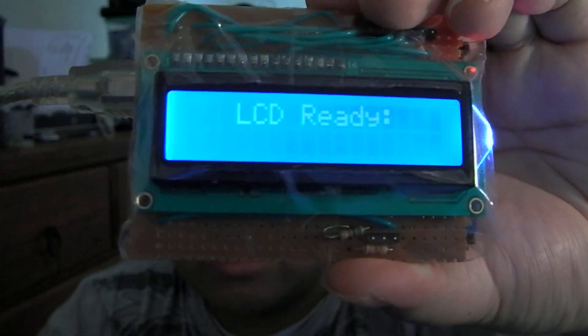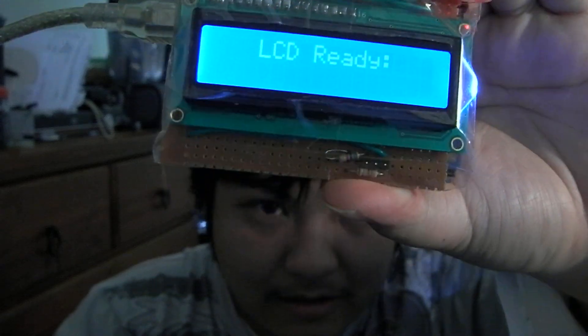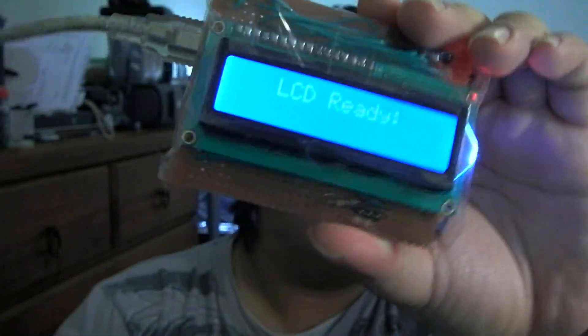So if you plug it all in and load up a sketch — you can find this sketch online — it emulates a Matrix Orbital LCD display with your Arduino and interfaces via serial. You tell LCD Smarty to talk to the port via serial to a Matrix Orbital display. As you can see here, this is just the sketch running. Let me just get LCD Smarty loaded up and I'll show you it running.